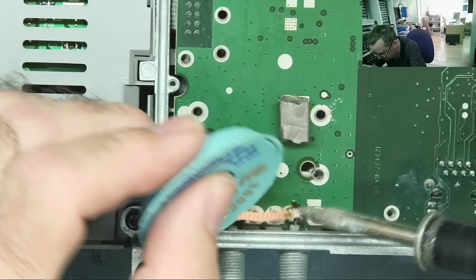And then this is the RF or UHF output, so it looks like we have a signal path through here, here to here. I can see this bit, and then from here into here. So there are some transistors up here, or MOSFETs. There's some chip here.